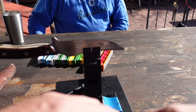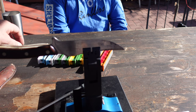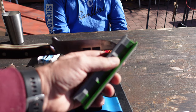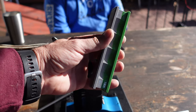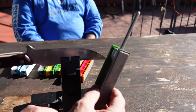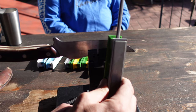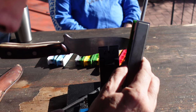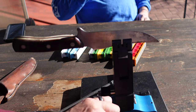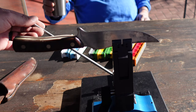So I've got my line on there now — it's time to find that correct angle. I'll go ahead and take one of my lighter stones, the 1500, because I don't want to take off too much metal while I'm trying to find this angle. That's looking pretty good. Just got to set the angle on the other side and we'll be good to go.